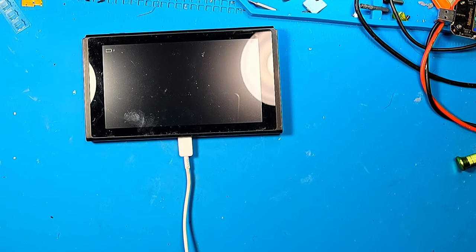So clearly that wasn't the problem, but I put a different Wi-Fi IC on there. I reballed it and put it on there, and still nothing. I was pretty proud of myself because I did all of this a while back, and it's still the same fault. So at least I put everything back, I think, correctly, because that chip's kind of small. But I don't know exactly what to do in this case. All the voltages look good.